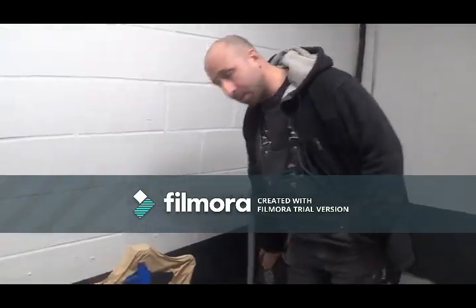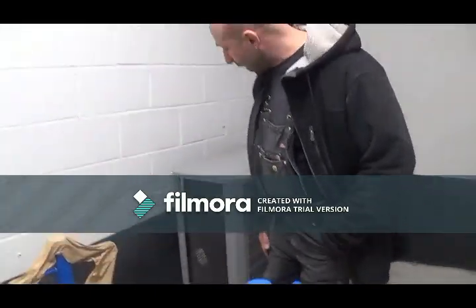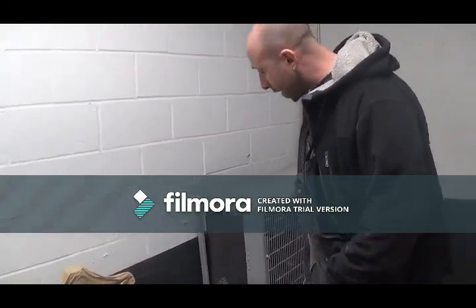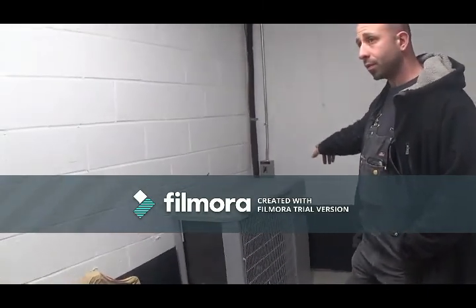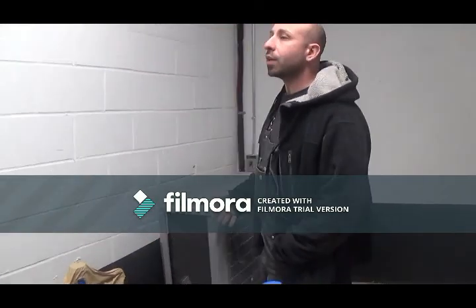Okay, so this is the condenser here. The only maintenance on this that should be required is to make sure that the coil is clean. If you see that it gets really dusty down here, it just needs to be power washed. So it's okay to use water? Yeah, make sure the power's off though. It should be cleaned every 3 to 5 years, depending on how dusty it gets, like if you get outside air coming through. But it should be okay.